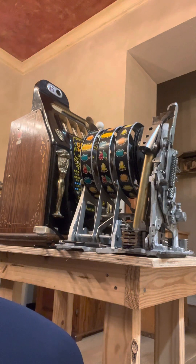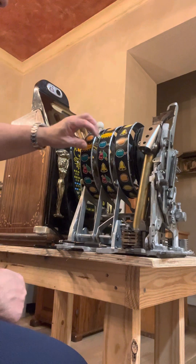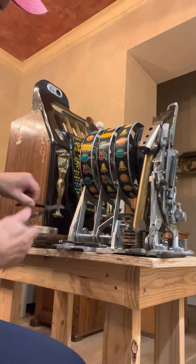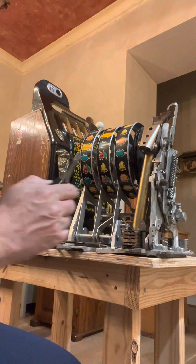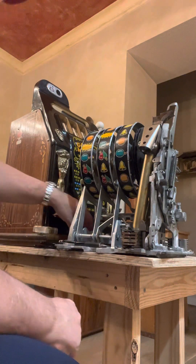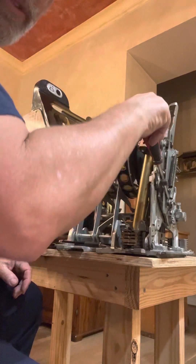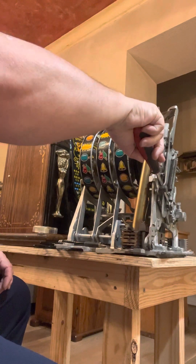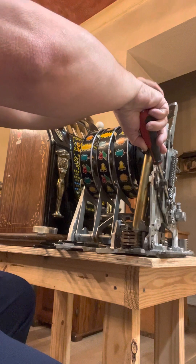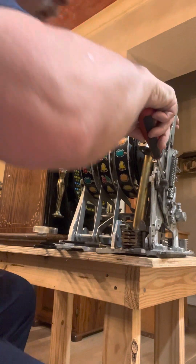So that's it, ready to go. The next thing we want to do is — we did mark these with tape to know where the reel strips end. I did go ahead and start using the wedge-ended pliers — you can see the wedge there — and that way you can kind of pry up the ends. The next thing I need to do is get this thing to stroke. You can use a piece that will fit over this to stroke it, but if you put your screwdriver in here and pull down, it's going to lock because it's checking for a coin and it's not there. So I'm going to reach and hold this piece right here while I do that, and that'll simulate having a coin in there.